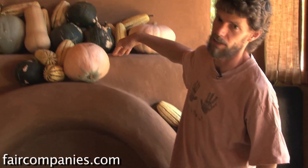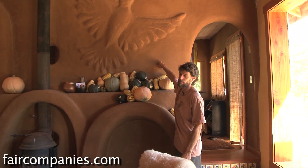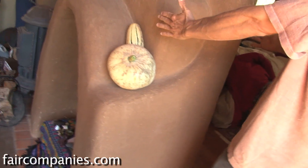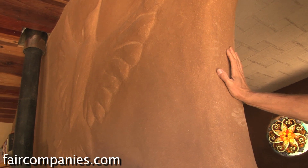From this point up, we switched to a different wall system — the clay wattle — basically because we wanted the wall much thinner at that point. It goes from about a 16-inch thick wall to about a six-inch thick wall. You can do that out of Cob, but it's just easier to do it with a different system.